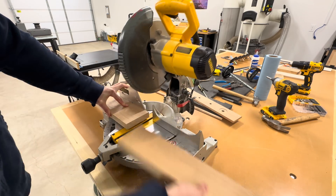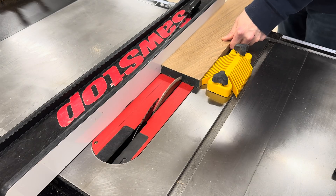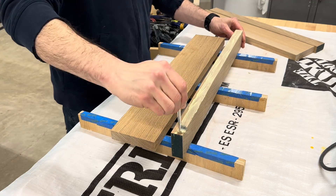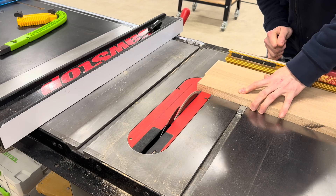The front jaw is made from a piece of white oak that I've had kicking around in the shop for about two years. It wasn't quite as wide as I wanted it, so I cut that piece into three lengths and then ripped one of those into two so I could glue up two wider pieces. Then I squared up the ends so I could get them to the final length.